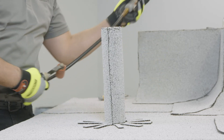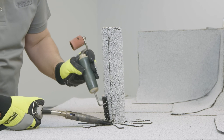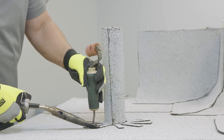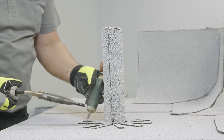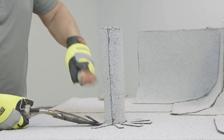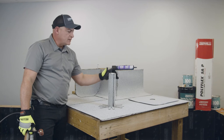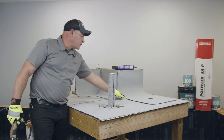With the plumbing stack seam bonded, I'm now going to start doing the finger flashings that are on the deck as well. Once the first piece of your finger flashings and pipe penetration is in place, make sure that you've got good contact and a good bond with everything on the over-granulated surface.